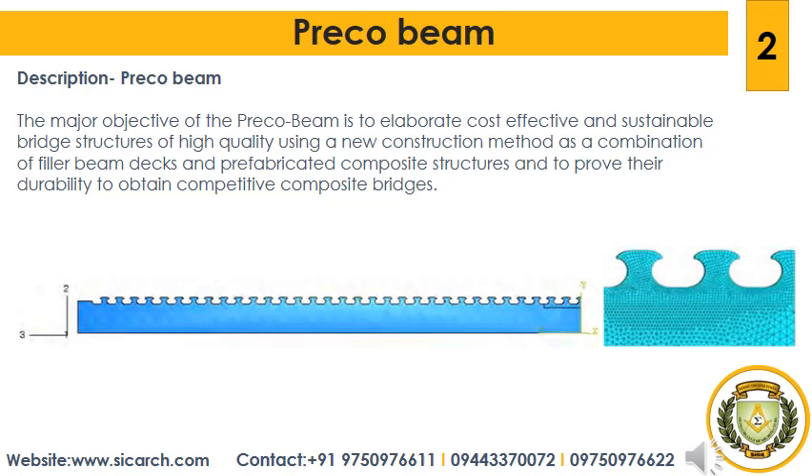Since 1998, bridges have been created using a composite prefabrication method of construction. The prefabricated composite beams consist of a steel beam with a concrete flange which serves as a compression chord and framework element for the cast-in-place concrete deck. These not only absorb the compressive stresses while the bridge is under construction but also stabilize the beam while it is being transported, rendering unnecessary the installation of bracing for concreting of the in-place concrete deck.